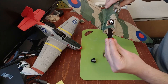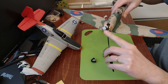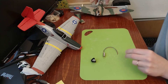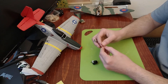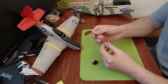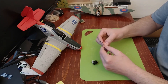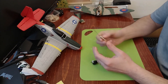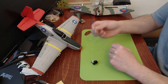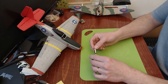If you go this route, you have to buy not only the propeller but also the propeller mount, which comes separately — I'll try to put it in the description below. The motor is often mentioned as brushless on the box, but it isn't — it's brushed, which gives less power than brushless. It has two cables, which gives it away. For the power needed here it's more than enough. I even managed to connect two of these in the Mosquito build; if they'd been brushless they would have gone out of sync.